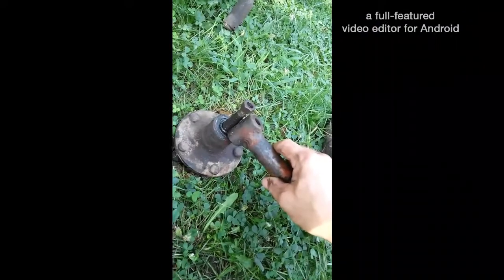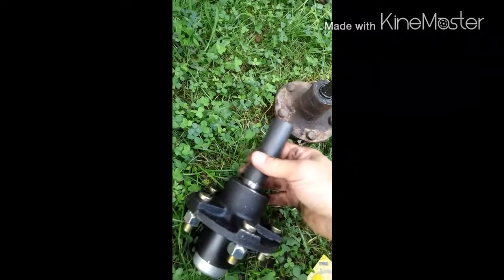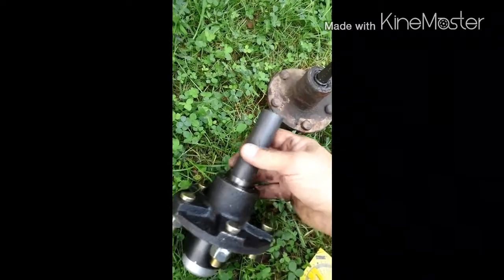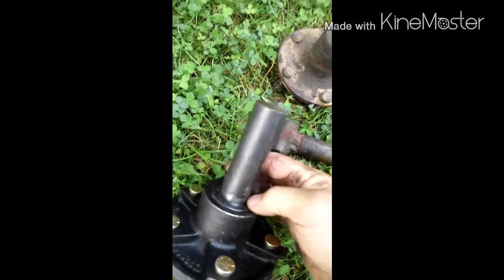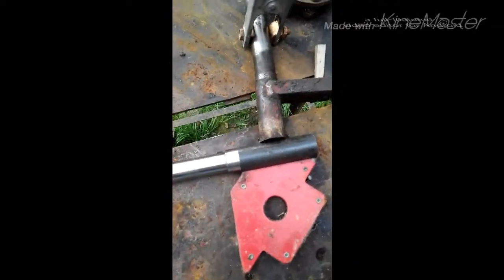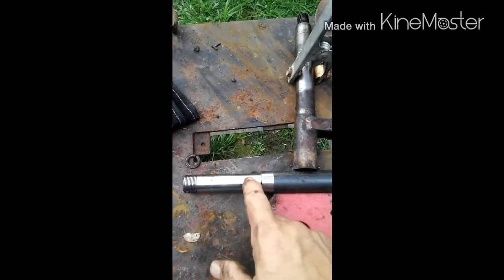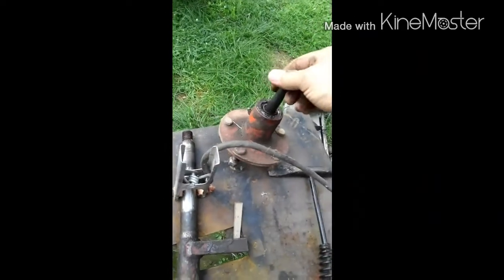That's just a real weak link. So you just lob this off, which is a job by itself, and then weld directly to this shaft. Now, you don't want to weld it all together because you have a dust seal — rubber back here — you'll melt. So you'll take it apart, and that's what you'll be looking at: that's a solid shaft unit, so it's a lot stronger than these little tinker toys.